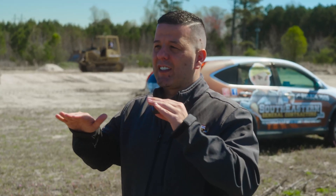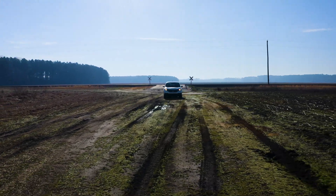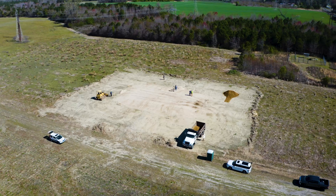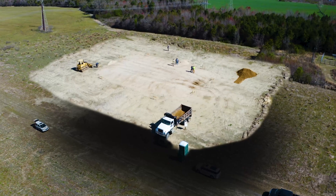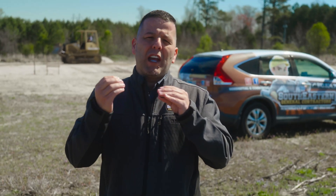As you can see, this is low land, so you definitely don't want to build on low land. You have to pay attention to your site plans, make sure the building pad is elevated so the water sheds away from the building, and then from there, you want to make sure you have great compaction.